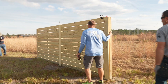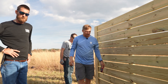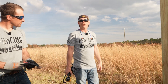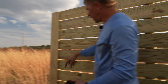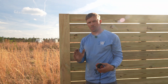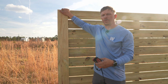She's leaning — they're all leaning about the same and wiggling a good bit. The concrete has all snapped, but this is all brand new fresh wood. You're gonna have a hard time getting it to fail. There's usually a few years down the road after it's sat out in the elements. In Florida it's always wet, but after it starts to rot, that's when we'll see posts snapping. The drier the climate, the more brittle the wood gets, and then when it flexes, it just falls over.